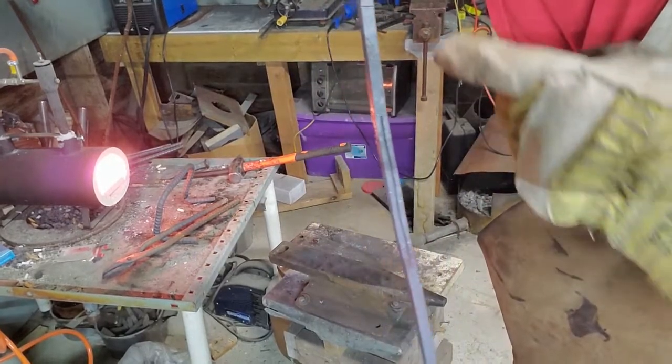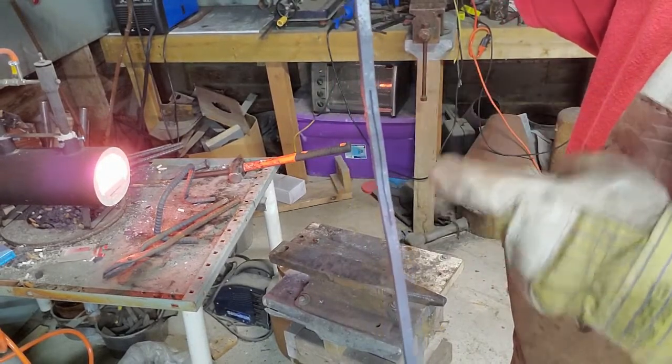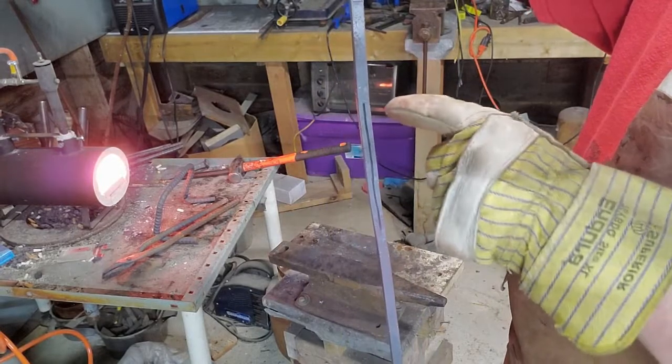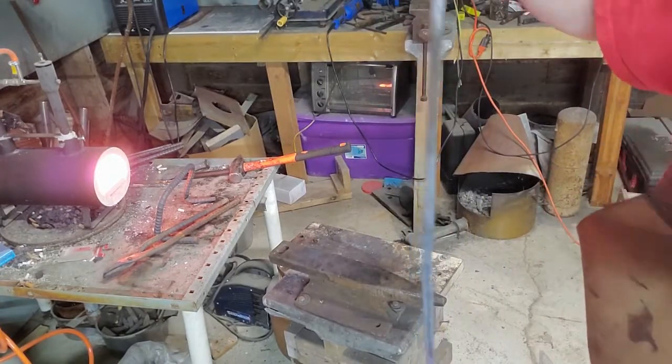As you can see, I'm making a mark as much in the middle as possible here. This is how you make a cubic twist. You first make a mark on all four sides, and then on two of the edges, you come and you make horizontal ones. And then when you twist it, they'll all pop out like dice, which is really nice.